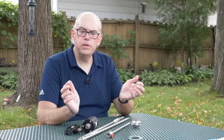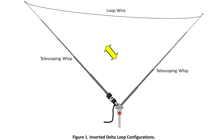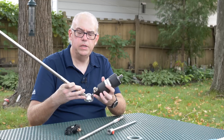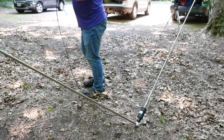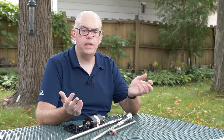The antenna can be deployed in a couple of different ways. First, as a ground-mounted inverted Delta configuration — this is the most common deployment. The hub is screwed into the ground spike, then the whips are screwed in on either side along with the transformer. The whips are extended, the wire is clipped on the top of the whips, and you have your full Delta-shaped loop antenna. A second version would be to elevate it. Chameleon states that elevating the antenna will increase performance and slightly lower the SWR on the upper bands, but at the expense of portability.